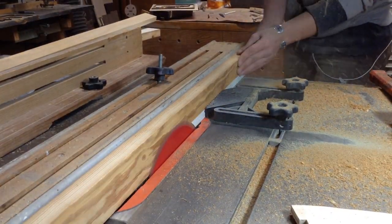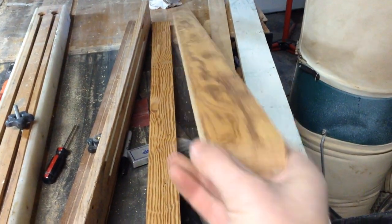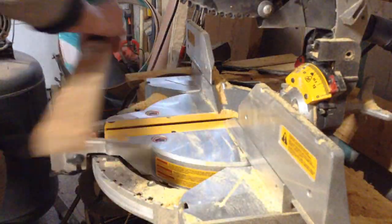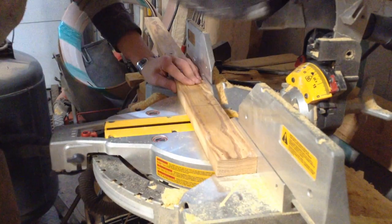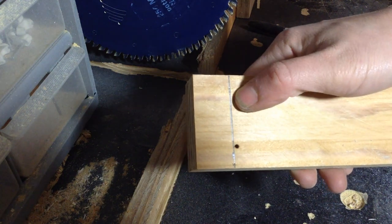I want to keep as much thickness as possible — the thicker and wider, the stronger the stretcher. I'm just removing the paint so I don't have to sand or strip it. Once done, you can see this wood, while not as old, is a pretty nice match compared to the newer yellow pine. The grain is actually quite nice, tight grain, which is probably why it's still so flat. Holding it up next to the base it matches pretty well — important for aesthetics and especially for finishing. I have a 48-inch top already made. With a little overhang, I set up the legs at the width I wanted, accounting for the thickness of the apron — probably about an inch to an inch and a half.